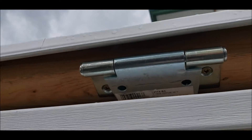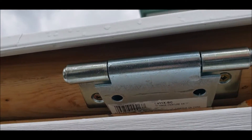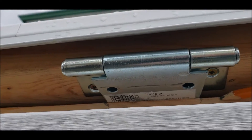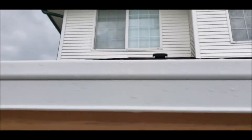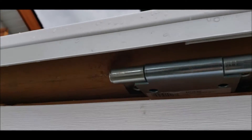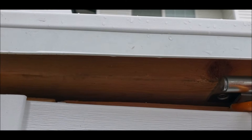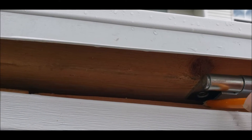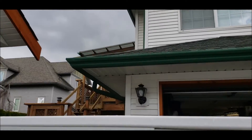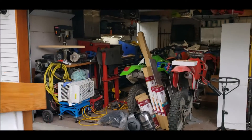I'm just going to mark out where these hinges go — they go an inch and a half from the back of the plate up to this board right in here. I think I'm going to have to put these hinges on the bottom first. Now I know where they're going to go, and inch and a half back. Let's take them off the top and mount them to that top plate instead.